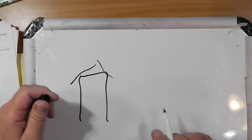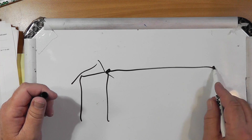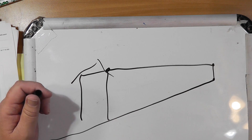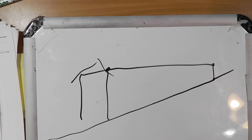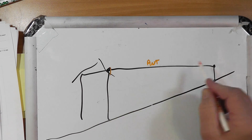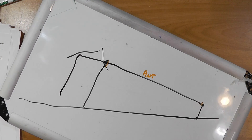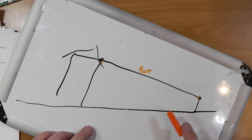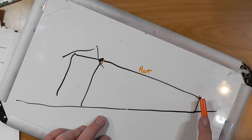He has a question about end-feeding a half-wave antenna, which is fine — you can do that easily. But his house is set up where he's going from up here out to a fence right there, and the land slopes. So here's his antenna, and looking at it, this sure looks like a sloper, where you've got level ground and a dipole that slopes down toward the ground.